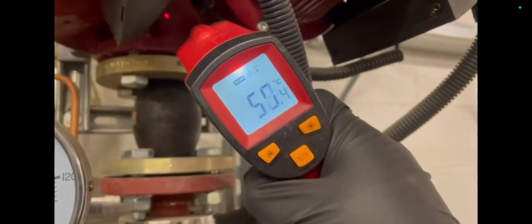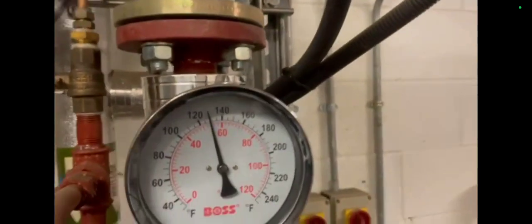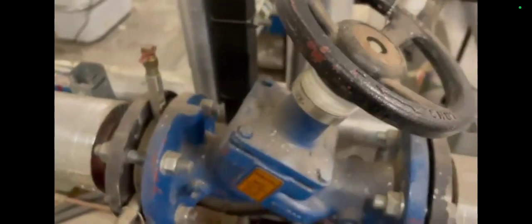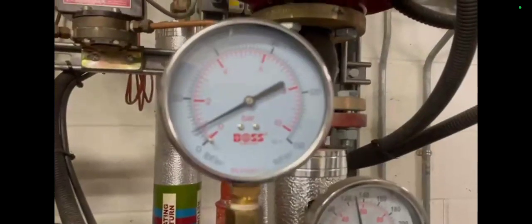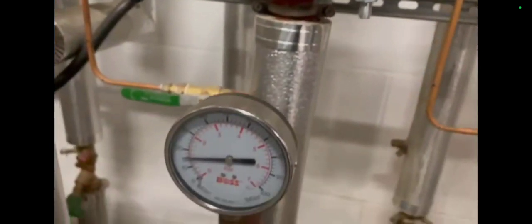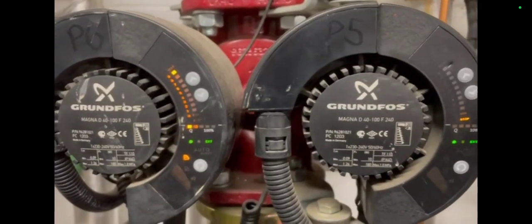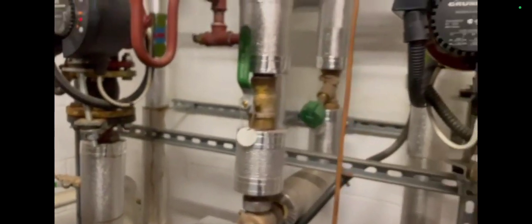I'd have to go through too many checks — the 26.9 checks: flue, air, gas, and safety devices. I can see my temperature at the boiler creeping up — 81°C now; the set point is 85°C, so it will slowly work its way up to 85°C. Checking out my pump gauges to make sure there's a difference. The gauge on this pump reads one bar; the pressurization unit said one bar, and then the gauge after my pump is creeping up to almost two bar. My Magna pump is telling me it's operating.